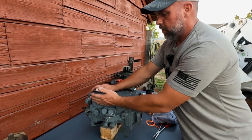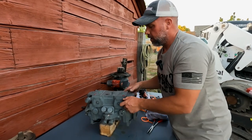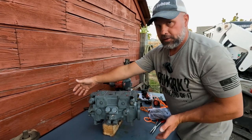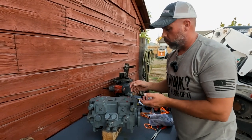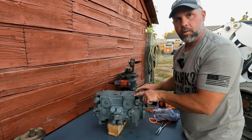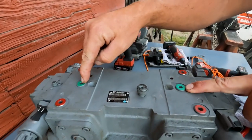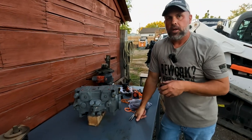We're going to get into setting this pump up if you've completely rebuilt it in a bit — we're just trying to focus on that swashplate sensor. Let's get back to these plugs I was telling you about. Once the pump is all put back in the machine with all the hoses hooked up, before we start the machine, when we took these halves off we drained every drop of oil out of this pump. We want to refill it. The ones I painted red are the pressure ports for either side of the servo — we're not going to mess with those. The green ports on top: remove one, put a tiny funnel in, remove the other one, and fill it up with hydraulic oil through one port until oil comes up out of the second port — that way we know the pump is full, primed, and ready to go.